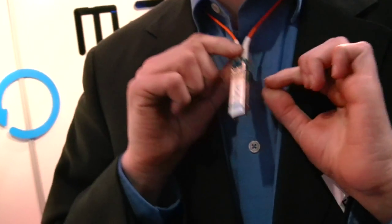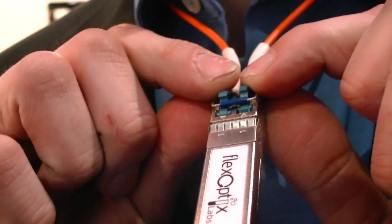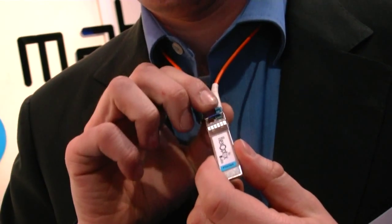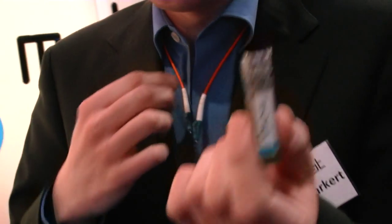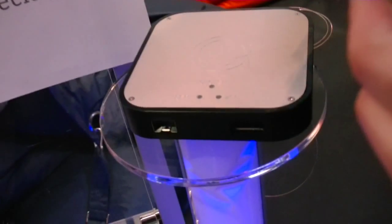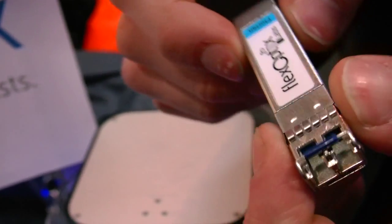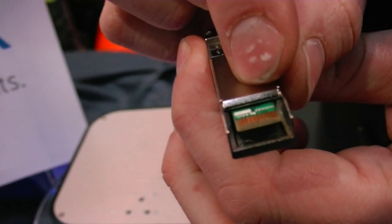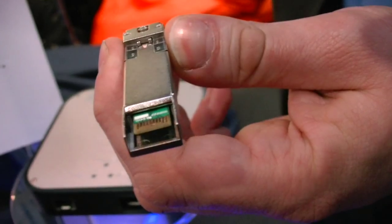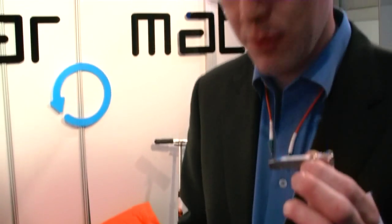That's an optical transceiver. Optical fiber connectors. So you use a fiber around your neck? To attach the transceiver around my neck? That's the reason. Usually, you can transfer optical signals into electrical signals. That's why you use transceivers. That means you have an electrical switch in your data center, and you want to communicate optically to another data center. Then you have to use a transceiver like this one.